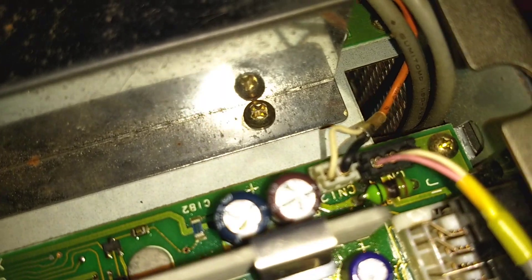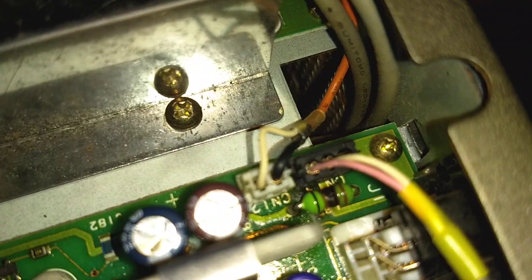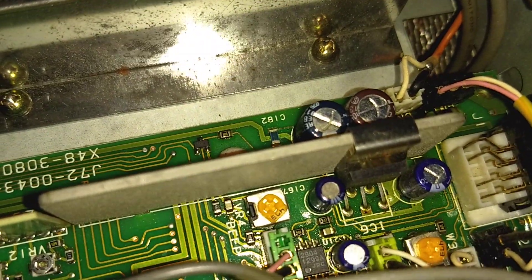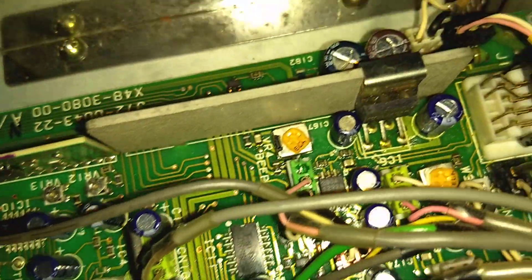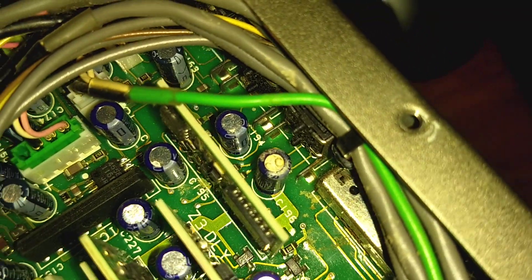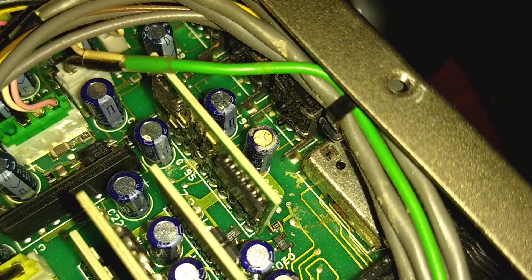So I've got to find that coil and find that capacitor. One thing I will mention: when you look at the top of these capacitors, they have an X on them usually. If they're at all swollen, they're a bad cap — just replace them, don't even question it. Those things should be perfectly smooth, and they shouldn't be milky colored like that one. It's pretty obvious that one has issues, and you can see it on the circuit board.